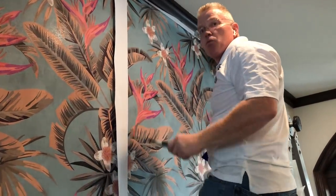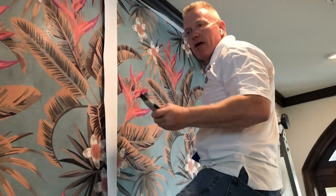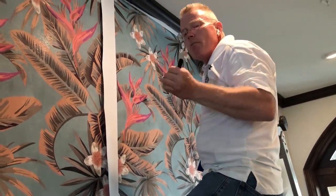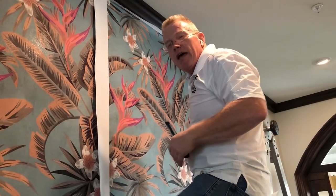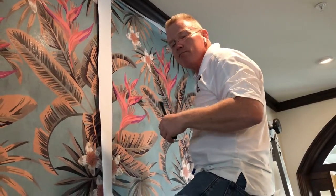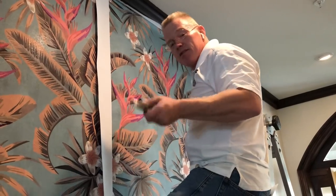Couple of considerations. One, you don't want to penetrate the sheetrock. We know that because once you breach the sheetrock, it allows for moisture to come in and out. Believe it or not, even that little cut on the sheetrock paper will let air over time come in and out, just ever so slightly within the wall. And guess what? That compromises the seam over time.